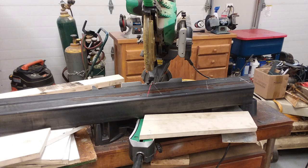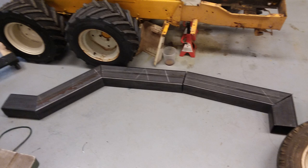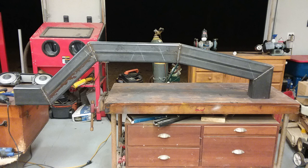I used a steel-cutting saw in my Hitachi miter saw — made for a lot of sparks. I don't have a cold-cut saw but this worked okay. Once I mitered the pieces of 4x6 steel tubing, I laid them out on the floor just to verify that the miters were correct — the two left miters were 45s. Then I began to weld it up, and here it is on the bench, welded together.